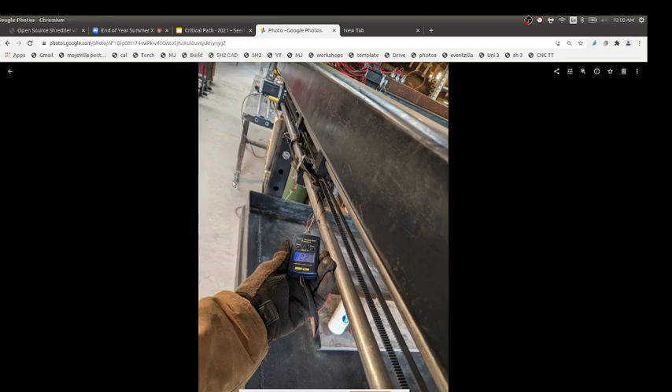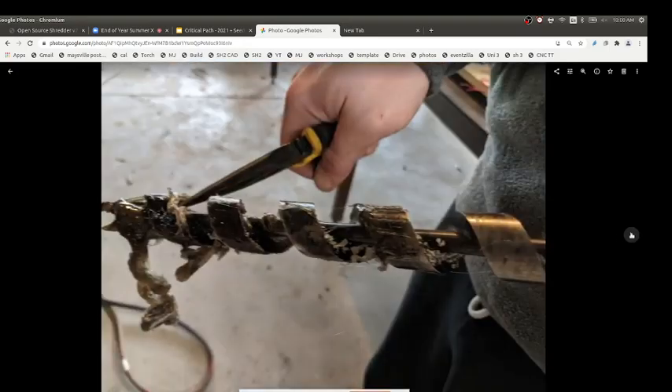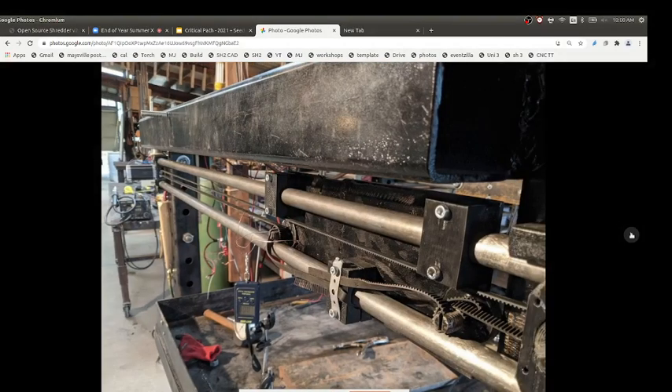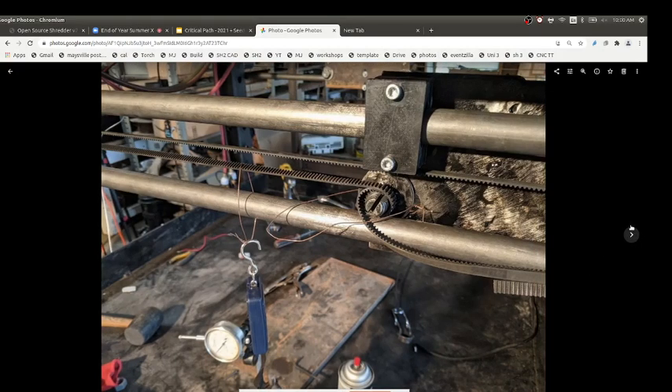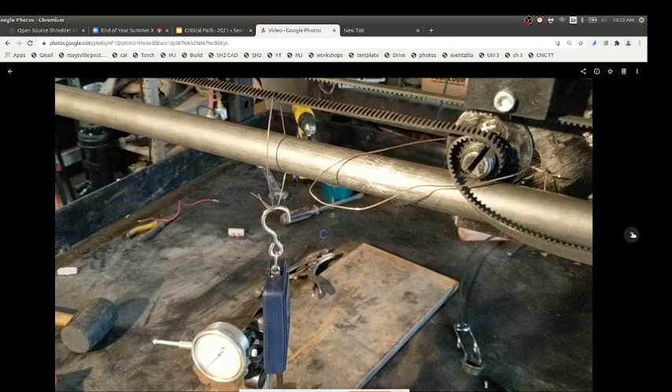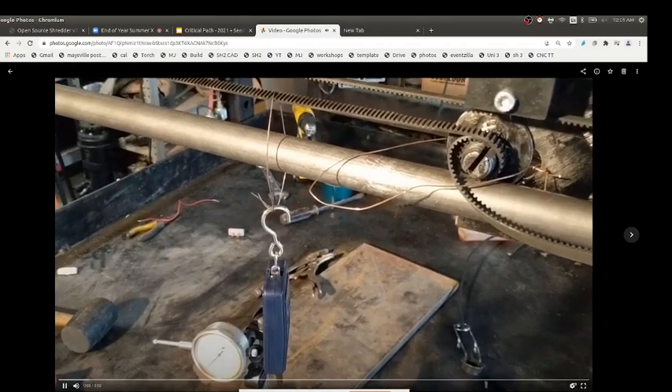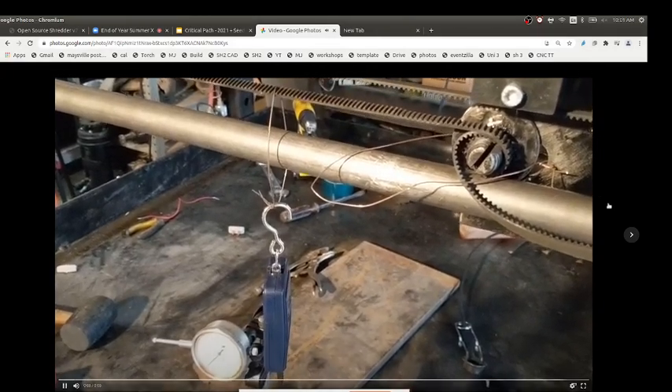Point two was actually pulling on the axis. For the backlash measurement, I attached welding wire to the carriage and moved it using the controller. This one here is measuring the actual belt tension — I was pulling on that. And here we're pulling on the actual carriage to see the amount of force. This system works pretty well — you tension it by screwing down the screw and tightening on the back with a bolt.